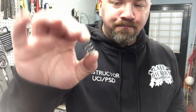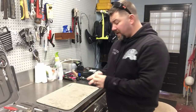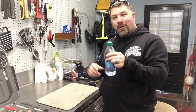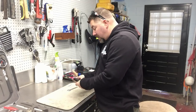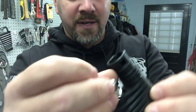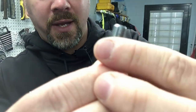Not only am I going to clean this for the customer, I'm also going to rebuild it. On this ergo inflator there's another spring system that I'll be checking as well. The way I clean these is very simple — this is something you can do at home. We take pretty much any metal parts and put them into an ultrasonic cleaner. A lot of people ask what I use to clean: it's a 50/50 blend of water and distilled white vinegar. Usually I'll just use a bottle of water and then fill the same bottle up with vinegar and pour it in — that gives me the right mixture. Any metal parts from our scuba systems go in there, same thing with regulators.